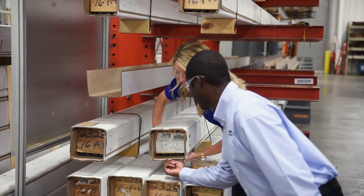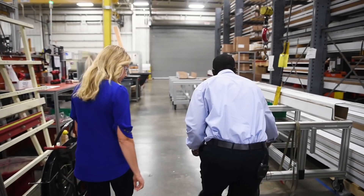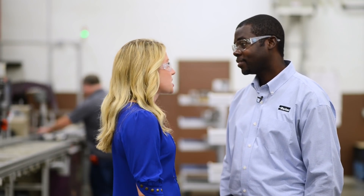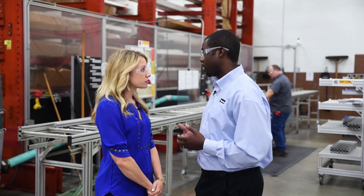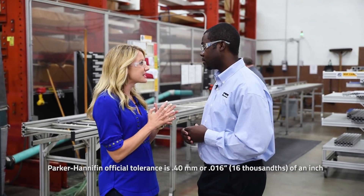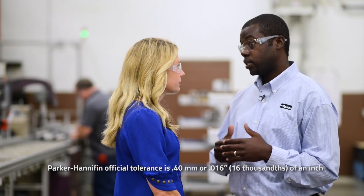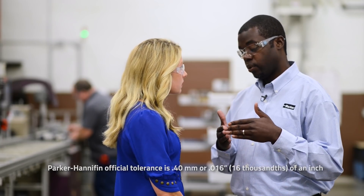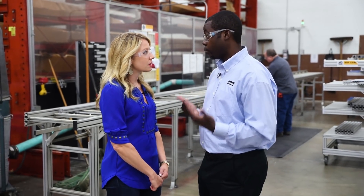Okay, maybe I need to work out more. The second step of the process happens right here. We've got Brad working a pretty awesome machine behind us. He's taking the extrusion from the storage area and cutting it to length, while also holding a four-thousandths of an inch tolerance. That has to be that precise — that's what we publish in our catalogs and what we hold ourselves to, making sure the material is square, because if you don't get it right it stacks up across the whole assembly and throws your assembly off.